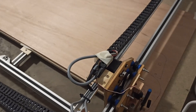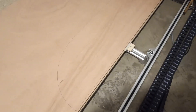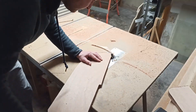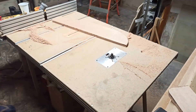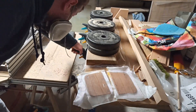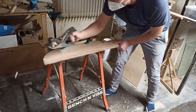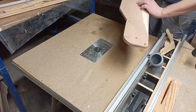I plotted the parts onto the plywood with my CNC plotter. The side plates and the rudder blade are made of plywood and were cut out with a jigsaw. The rudder blade consists of two 8mm plywood pieces. After I trimmed the second piece flush to the first one, I glued the pieces together. The rear edge of the blade was then shaped with a hand plane and a grinder. All other sides were rounded with a router.